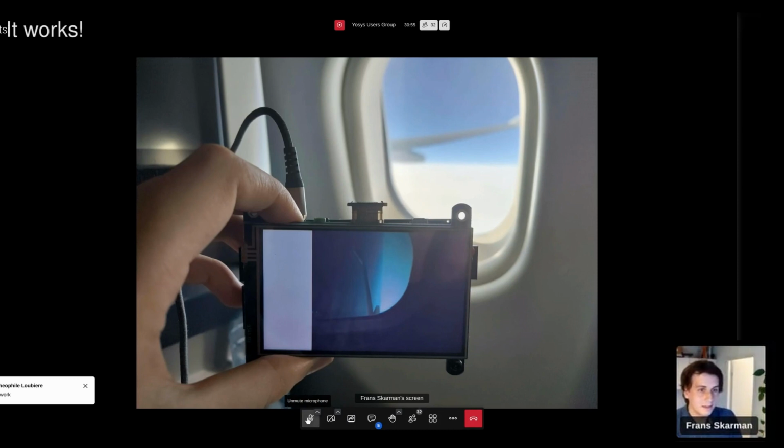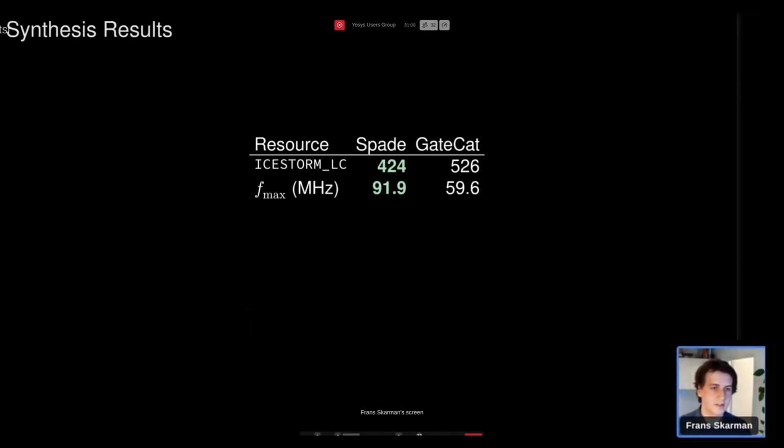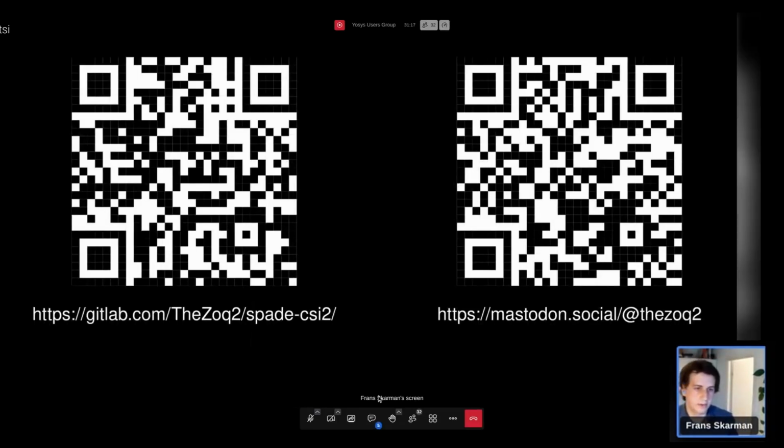One minute. All right. Synthesis-wise, this thing is slightly faster and slightly smaller than Gatecat's implementation, which I'm very proud of. It uses about 500 LUTs, so it could run on a very small iCE40 if you wanted, and runs quite fast. So yeah. If you want to learn more, I have a GitLab repo, and if you want to see me ramble about this project and everything else, you can follow me on Mastodon.